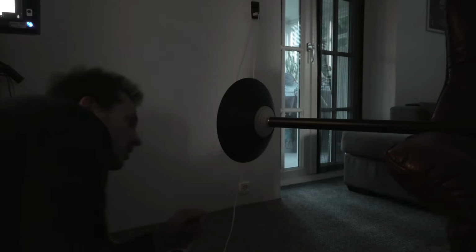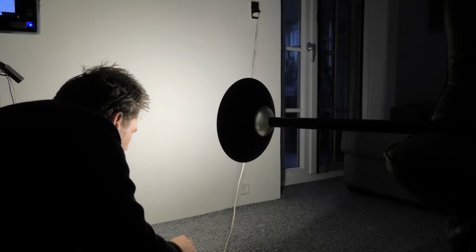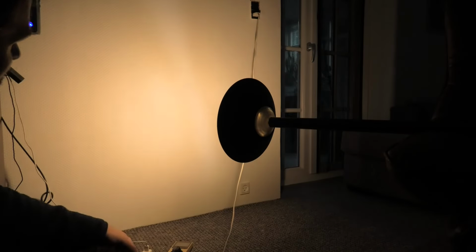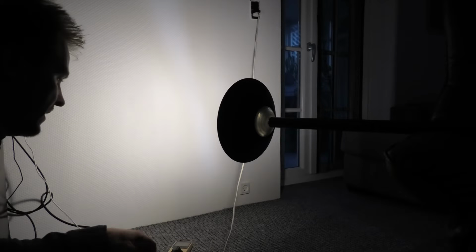This one was 10 watts. Yeah, a decent amount of light actually. Let's not dim it then, if we're gonna blow up light bulbs that way. And it uses 7.5 watts. Next, this is this glass one, and this one was supposedly 15 watts. I have been looking into the light too much. So let's put that in. Yeah, I remember it's a tight fit. It doesn't light any more than the 10 watts, and it only uses 4.2 watts, so it's definitely also giving out less light. So yeah, I got ripped off there. That was a bad one.